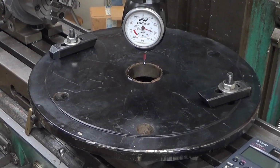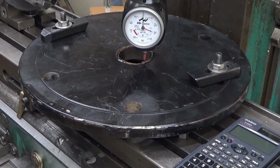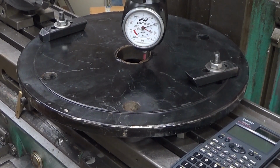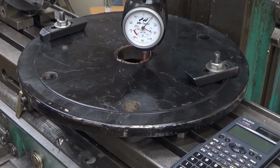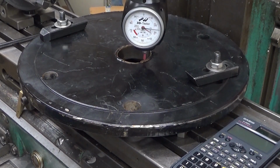Let's first have the needle somewhere near. I'm using my Haimer here. This is probably the best device for this kind of task. Let's put it a little bit deeper, like that, okay. Now I gently touch it first and then try to find the minimum here. It's already quite in the center. Let's put a little bit more. The x-axis of this milling machine is really sensitive. I'm dialing the Y in. Now you can see it rises, went down. I think that's about our center point.